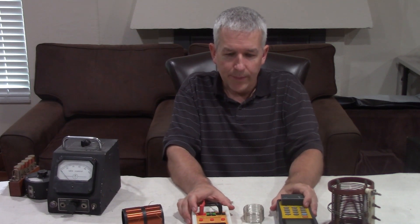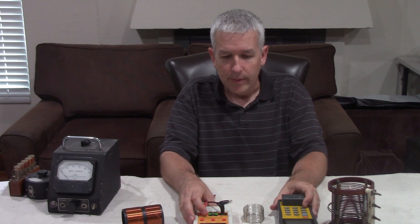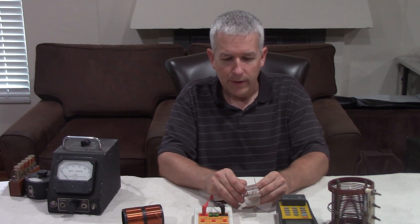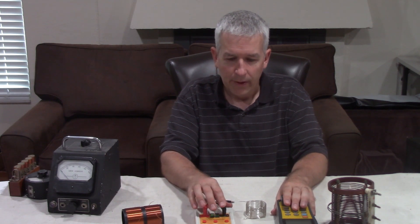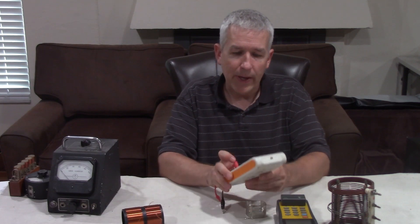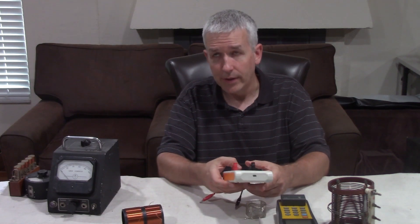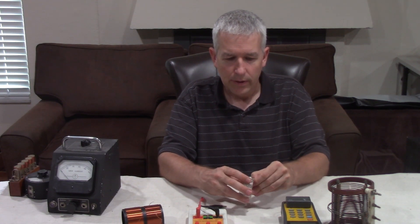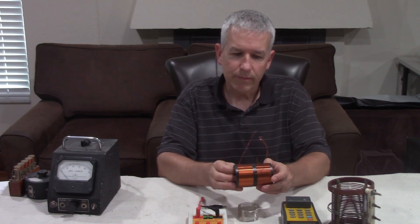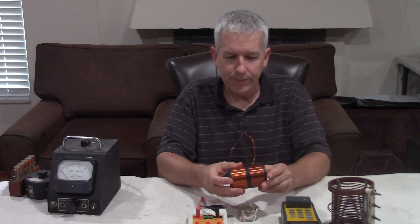It's convenient to have an LCR meter that's frequency specific. But you can cheat a little bit and get an estimation once you get used to working with coils and know approximately what the value would be, then estimate it with a lower maximum frequency. A coil like this will be somewhere up in the megahertz range because it's quite small.